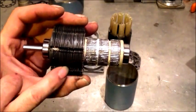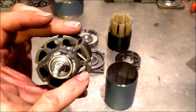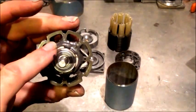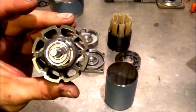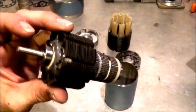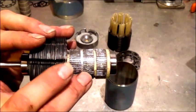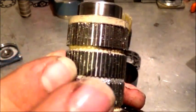I've got all the laminates now stacked halfway down the inner rotor. I've got glue on one side holding it in place, and right now I'm using some thin string to keep the distance between each laminate plate. Once I've got the whole thing stacked, I'm going to run one little line of epoxy down the keeper pins on either side — just on one of these arms on either side — and that's going to lock them all to the exact distance I want without the string. I'll unwrap the string once that's done.